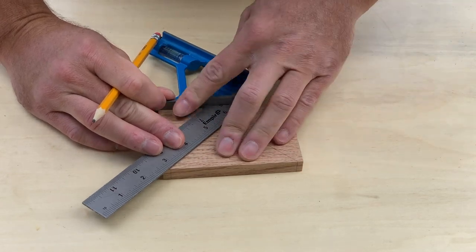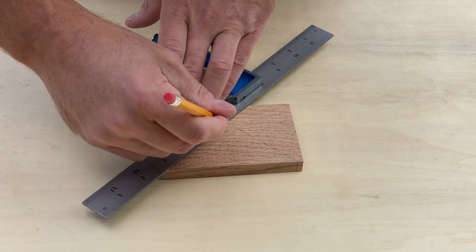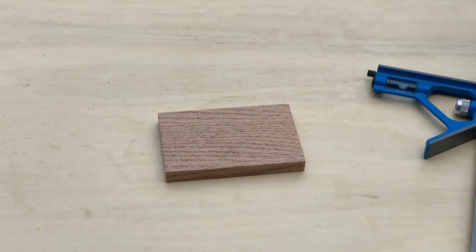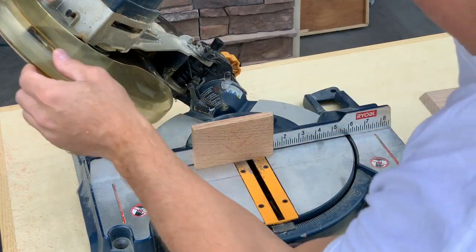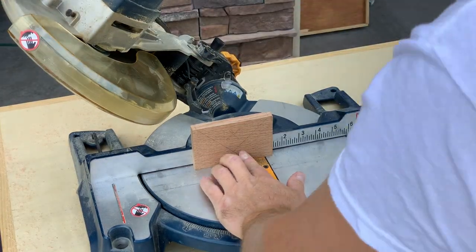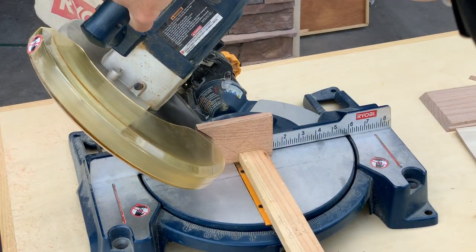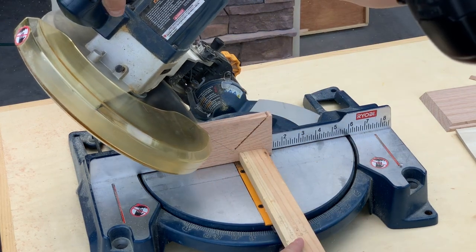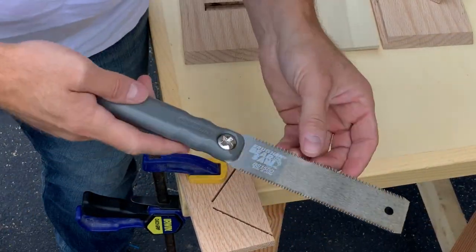Cutting that V was kind of interesting though. A bandsaw would have been perfect, but mine was still sitting at the store that one day I hope to buy it from. My scroll saw would have worked well too, but I've broken a bunch of blades lately and need to buy some new ones. The piece was too small to get any decent clamping worked out for a handheld jigsaw. I probably would have had the best results with my table saw, but I decided to get creative with my miter saw. I tipped the saw over to 45 degrees and held the piece in place with some scrap. I stopped my cut short of the line with the intention of using my new Japanese pull saw to finish the cut. Unfortunately, the saw bucked a bit when I let go of the trigger and I ended up cutting past my line instead of short of it. So I had to adjust my other cut accordingly and made sure to lift up the saw before letting go of that trigger. I brought the piece over to my bench vise and used my Japanese pull saw to finish the cut and remove the waste material.